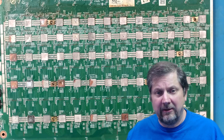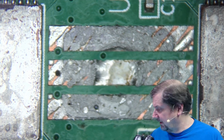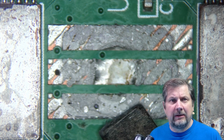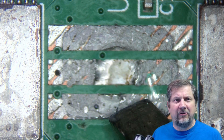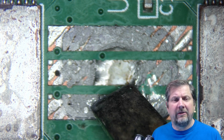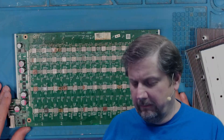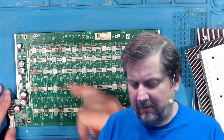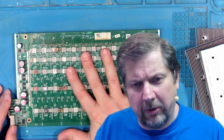Good news is this was the old way of doing it. Under the microscope you can see the solder didn't really get activated — it didn't really flow like it was supposed to. That's part of the problem. This was before I had suggestions about cleaning off the board, taking the solder mask off, and then soldering them back on. That's how I've been doing it and most of the time it works really well. Since 20 of 28 nuts fell off, there's no sense keeping the other eight. I'm going to desolder these eight nuts and clean up all the pads.